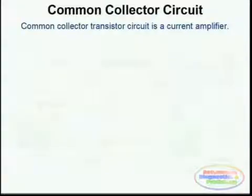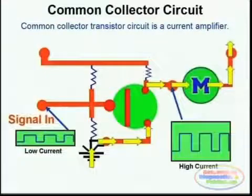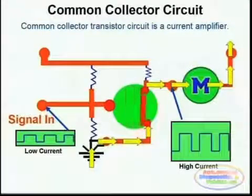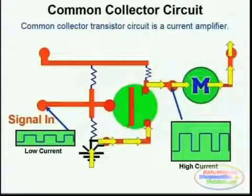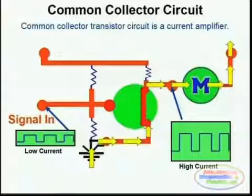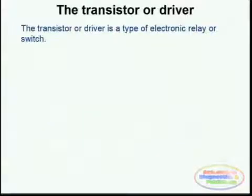And here we see how the transistor becomes an on and off circuit, which can be pulsed. Remember, you cannot duty cycle control a component using a relay unless you use the relay to provide the voltage source. You have to use a transistor to pulsate a device.